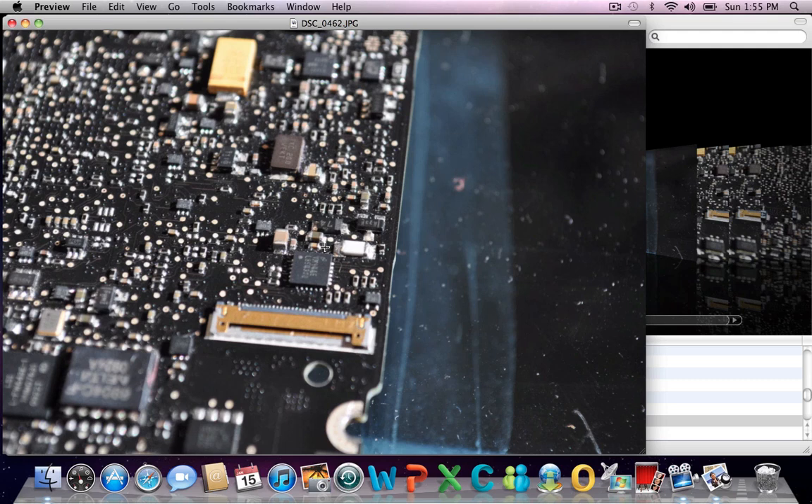What we have here are the still pictures — close-up pictures showing where the fuses are. You can see where this VGA connector for an LED screen plugs in. Here you have a QFP package that actually modulates the power across the board. Power comes through here and then goes to this fuse, comes to this package, and then powers the screen to turn on. This is the actual fuse that's bad on the one unit we were speaking about. But we're also going to open up the still pictures for the other fuses so you can get an idea of what they look like and where they're at.